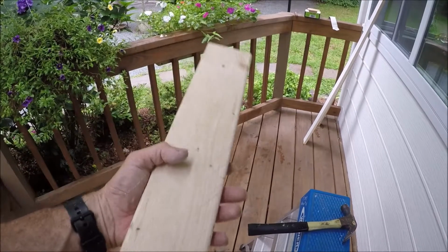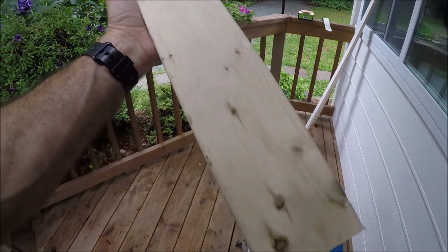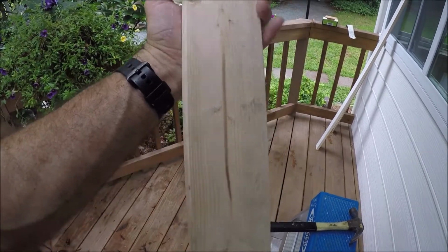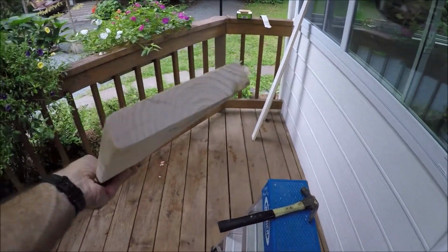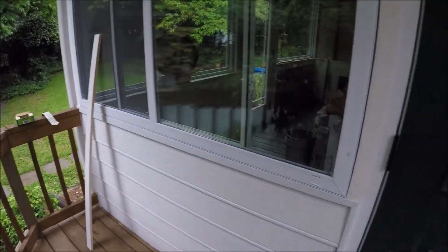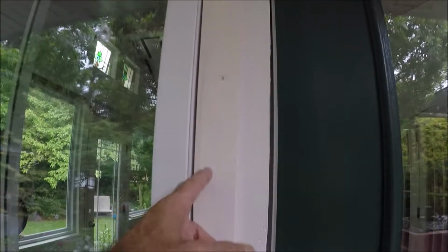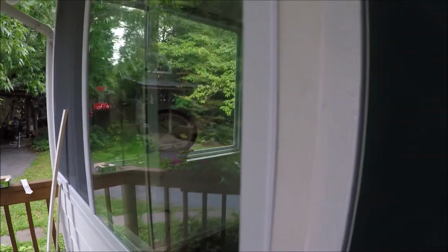All right, I'm finishing up my porch here, and this is what I'm cutting down to trim. This is just almost a scrap board at Lowe's. A 1x4x8 is $2.95. But actually, if you sand it and the edges are eased, and I'm just ripping down the size that I need, like this porch slopes off, I had to slope that to fill in the gap down here and then over here so that my reveal would be even. I've tapered this board. I've only got a couple of nails in it, but that's going to leave me just enough of a caulk joint. And over here, I've got a nice eased edge already.